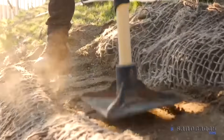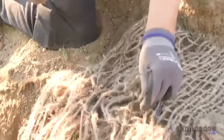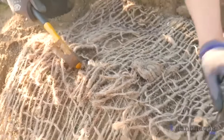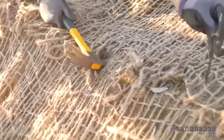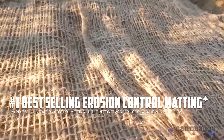Use the 12 inch section of netting above the trench to cover the freshly compacted area. Staple every 12 inches, making sure to drive the staples flush with the soil. Apply staples every 18 to 24 inches throughout the netting to minimize shifting. Overlap edges of each additional section 4 to 8 inches before securing with staples.